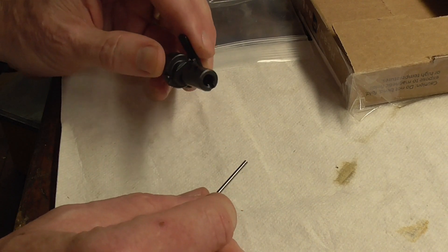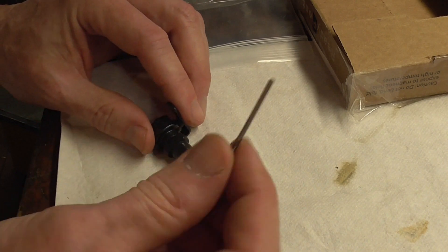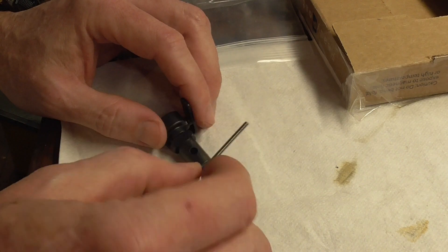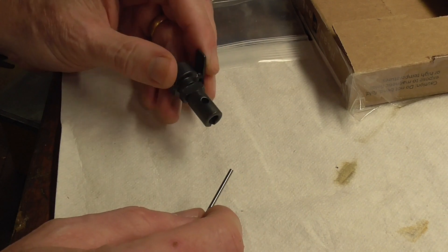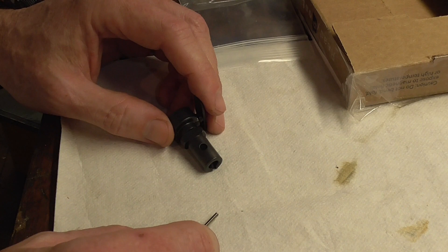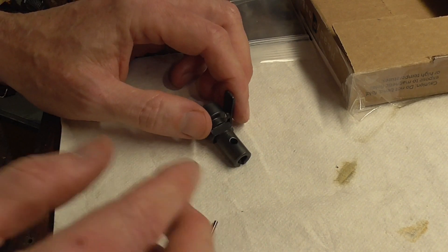So I'll video how that works. Basically grind, grind, weld, weld, re-drill it while center punching in the weapon to get the right location. Then drill with 5/64ths — this is a 5/64ths drill bit. Clean everything up. And then test fit it in a gas block. Let's go do the parts.